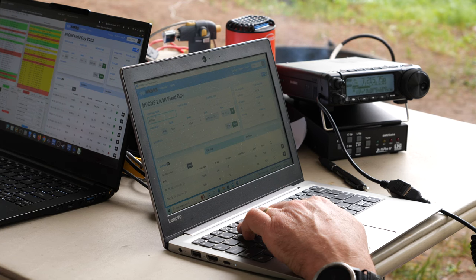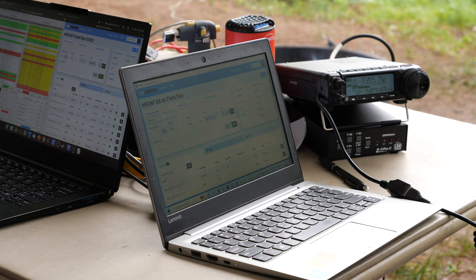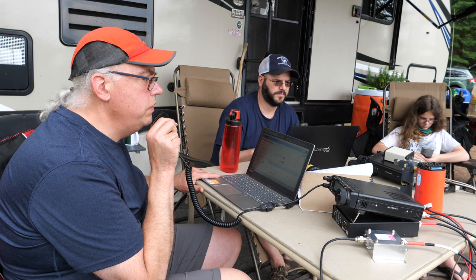It is important to know that this is a tuned circuit. You can transmit through the filter if your transmit frequency is within the passband, but you can also damage any of these filters if you transmit outside of their specified range. Bandpass filters are vital if you're doing a Parks on the Air activation with friends. We can operate on different bands in close proximity to each other and keep interference to a minimum. They won't block out everything, but they are good enough that you can copy weak stations on 20 meter phone without having that 40 meter FT8 signal blasting through. If you're setting up for field day, bandpass filters are essential for everyone getting along. Anytime you have stations and antennas in close proximity, you will need an external filter. But you do need to remember to remove or change the filter if you change bands.